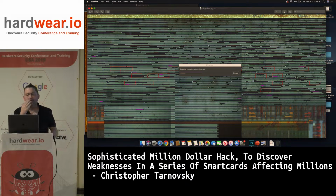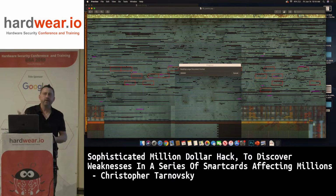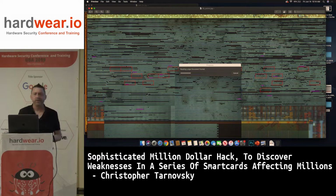On Atmel's, like I told you yesterday on Samsung, it's another RISC design. So again, cut the D15 line. You cut D15, the chip can't branch. If the chip can't branch, it powers up at 0, goes to 1, 2, 3, 4, 5, and I'm just listening with needles. It's great. I love RISC processors.